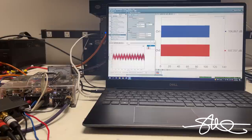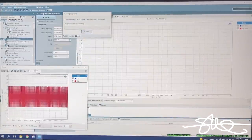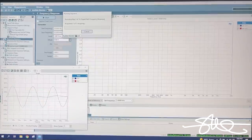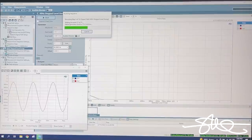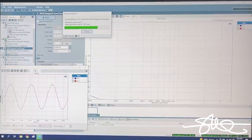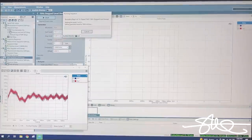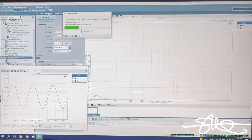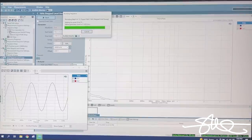This is the SMD HLC2. Let's run it - I got the scope popped out this time. Frequency response test. 40 hertz swept level distortion - we can already see what you're paying for. That 40 hertz distortion isn't even on the screen, it's so low. At only 100 millivolts out we're at like 0.015%, and after that it goes off the screen - the distortion is so low. At 40 hertz even. Very different when you have an active design with active amplifiers. At 1 kilohertz swept distortion: same thing - distortion's off the graph.